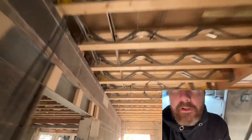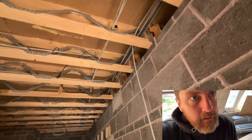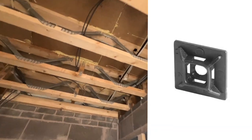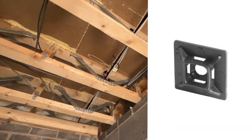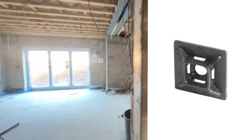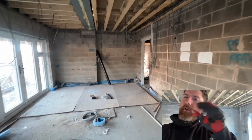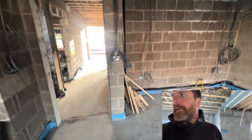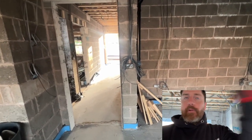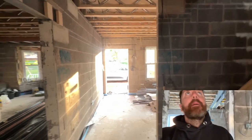What we do is we get cable tie bases which have a sticky pad on the back and you put a screw through them. If you go a bit too hard with the screw it will break because it's plastic — it doesn't actually break, it just makes the hole a bit bigger. You screw that up, then your cable tie goes through it. Leave it like a big loop so you can feed your cables through nice and easy. There's less risk of snagging because it's plastic with a bit of movement, so as the cable goes through it can move left and right.